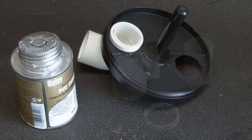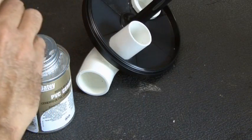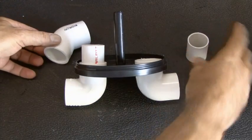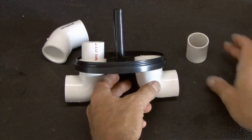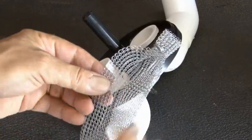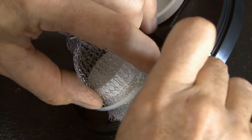Now it's time to glue together our other 90-degree elbow and our one-and-a-quarter inch piece of PVC pipe. That will go through the other hole on our CD spindle and be fastened by our second quarter-inch ring. Now it's time to glue our 45-degree elbow in place using our two-inch piece of PVC pipe. I'll be using an aluminum washing machine lint snare, which will act as our filter. After cutting off a section of that, it'll go over our last fitting and be secured in place with a zip tie.